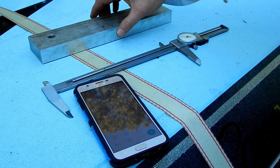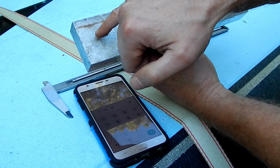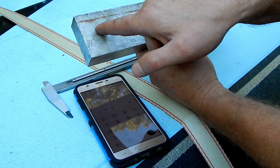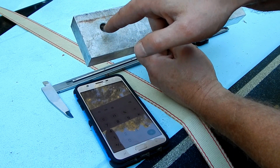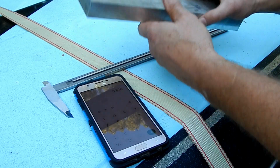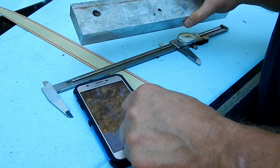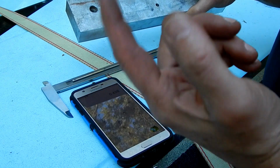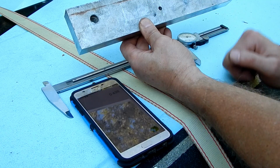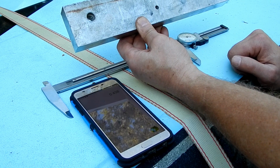So what I'm thinking is if I turn these into elongated holes and I just increase them, I move this outer edge basically out and in effect create an oval hole here by half the distance of this, 438 thousandths. I should be able to put this bracket on there on the existing bolts using these two bolt holes, and they'll just be slotted, that's all. Which I don't care about that.